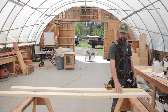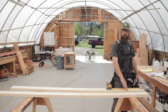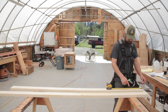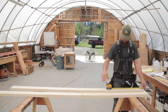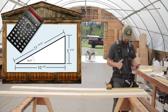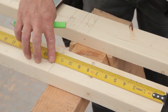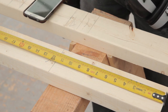When laying out an angled rake top plate, I like to work off the short point of everything — I just find it the easiest. You'll need to find the run on each stud as you go down. For this first one the run is 10 and 3/8 inches, and I'll use a calculator — you can use the Pythagorean theorem if you like. That gives us 11 and 19/32 inches. I'll do the same process for each stud.